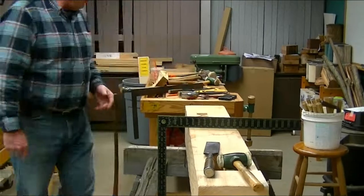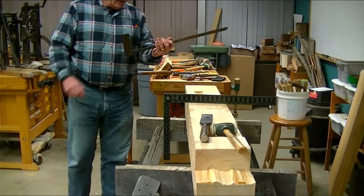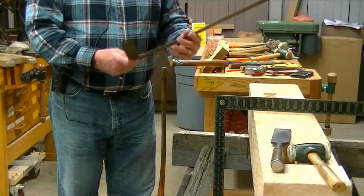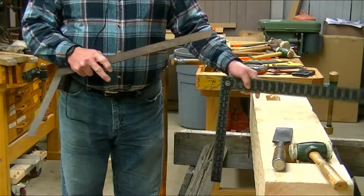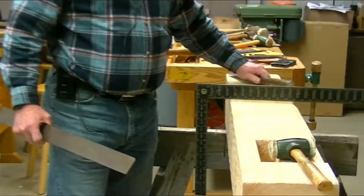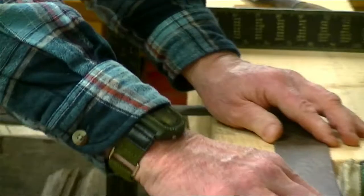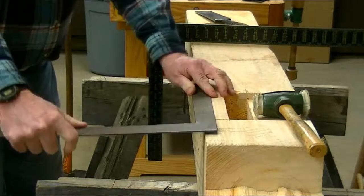This is a modern framing square. Here's an example of another one I have — this one actually has a stamp of 1805, which is back in the scribe rule era of timber framing. It gives you an indication of inch and a half here, two inches here, inch and a half here, two inches here. Those are common dimensions of mortises and tenons. This is a two-inch frame, so I can use my framing square to lay out two inches and then two inches. If I'm doing a smaller timber, I'd use the inch and a half.